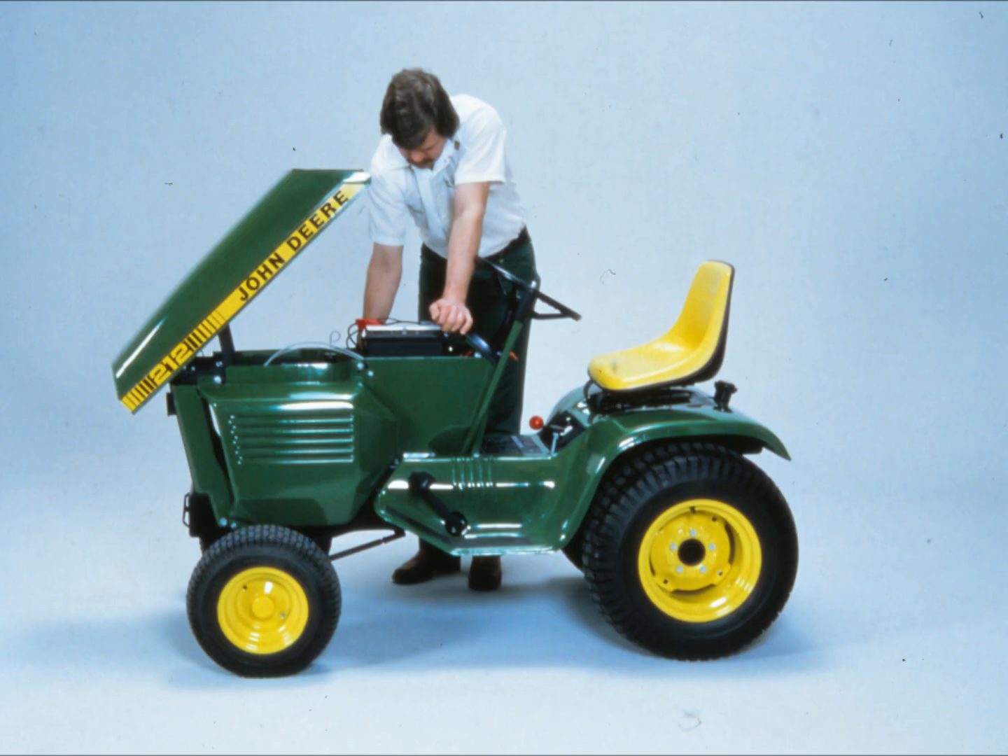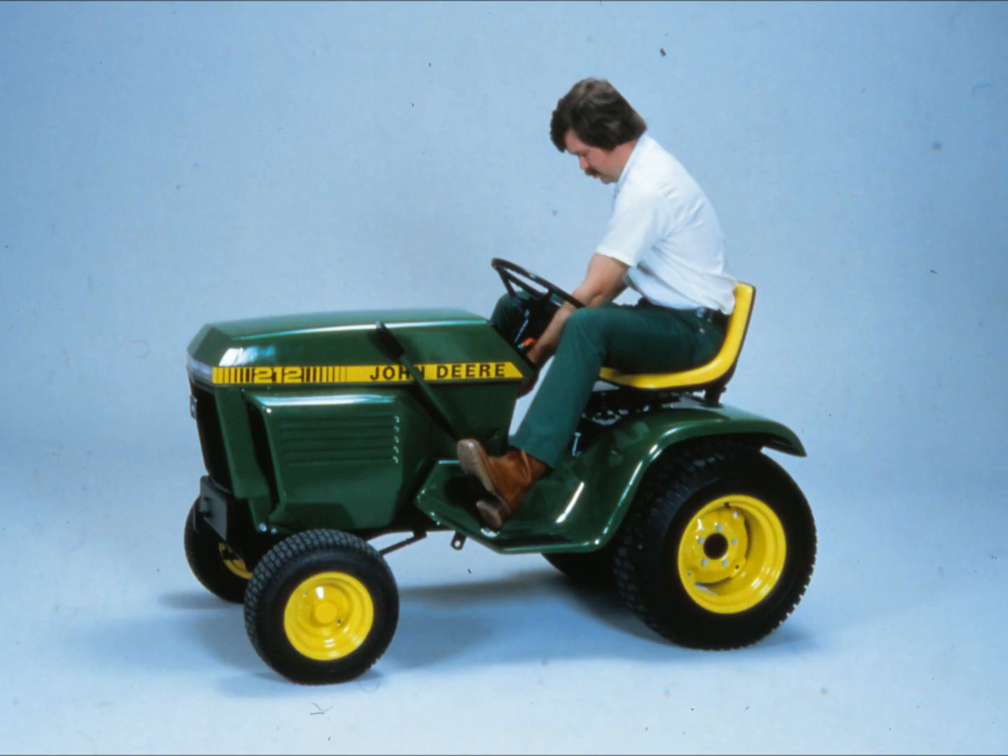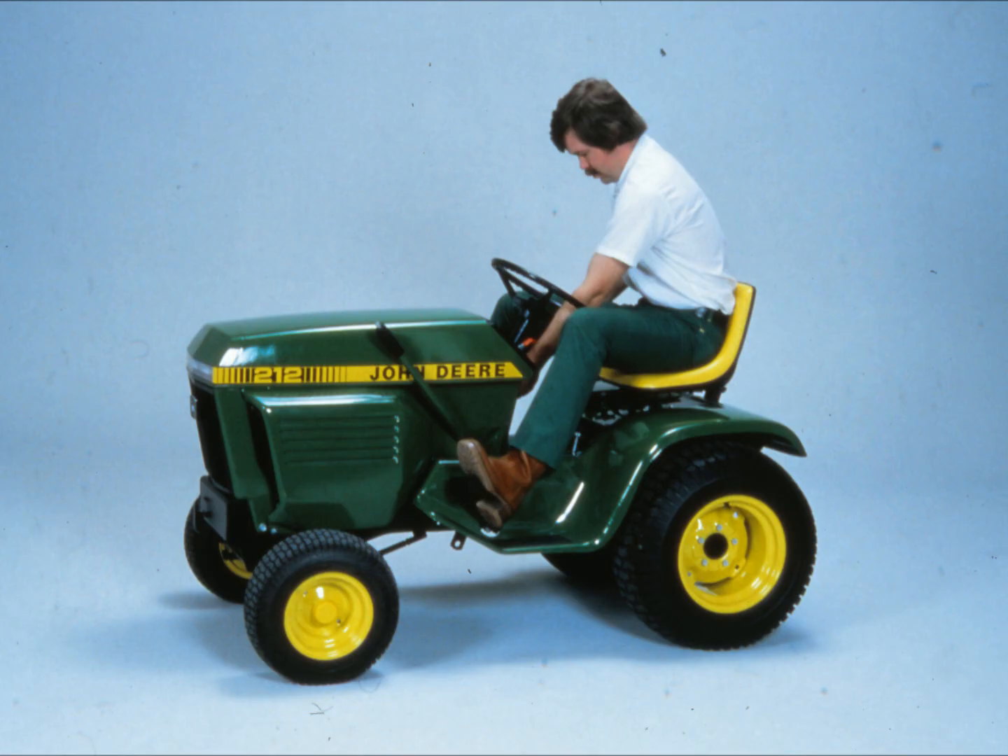Look for things like broken wires or loose connections. Then go on to step four of your general troubleshooting procedure: try starting the tractor yourself and take note of any symptoms. For example, perhaps when you turn the key you hear the solenoid click but nothing else happens.